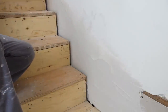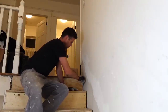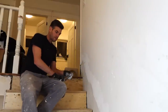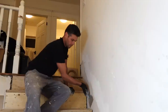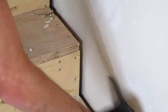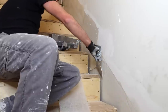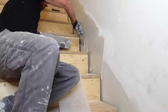I'm happy with that. This is all set up but it's not actually dry, and this is the easier stage to apply fiber fuse — when it's fully dry it can be a little harder because it pulls the moisture out of the mud faster. So right now I'm just knocking down any high spots so we can put this tape on and have it come out pretty flat. We've got some fiber fuse cut down to about 8 inches — they make 6-inch rolls, but the gap here is about 6 inches so I need something bigger.